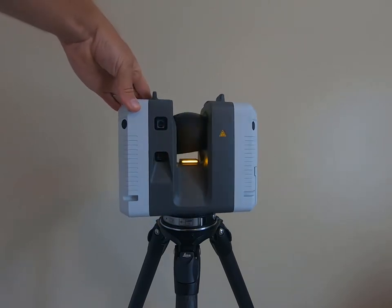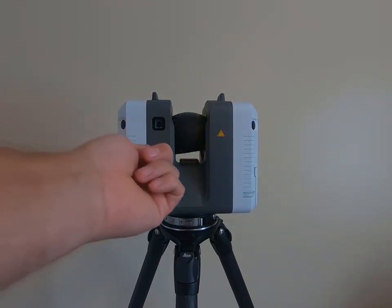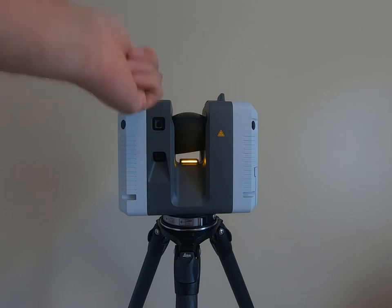On the outside of the unit itself you have three cameras on the front side that are behind little panes of glass. Each one of these cameras is a 12 megapixel camera and it makes up the three camera system used to take photos to colorize the point cloud with. At every position the cameras will take five different images — each camera takes five images — and it's a multi-tiered HDR image. There are 12 positions altogether for that.